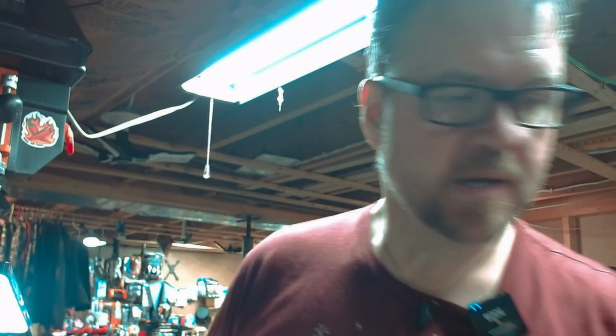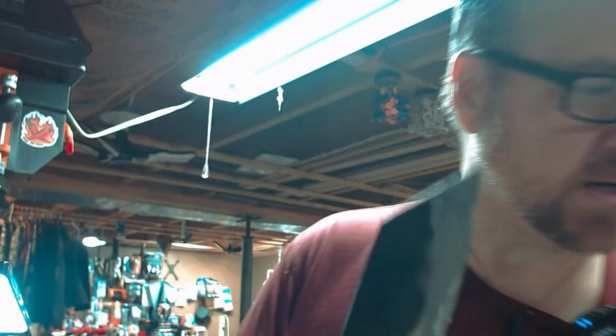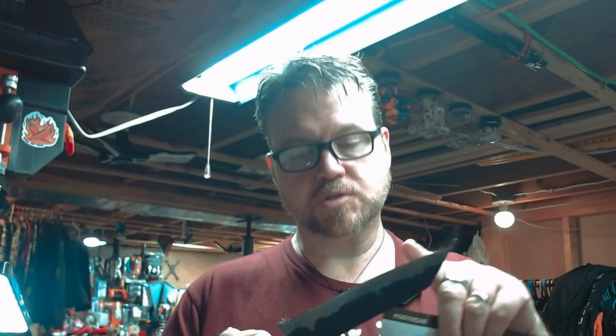I'm doing the ALTSTONE series, the Fukami. This is the 5000 we're going to do now. I want to show you guys a little something real quick first. I noticed that whenever I did this yesterday, we didn't quite get the push cut I was wanting, and there are some of the gouges I was talking about. But I worked it on the strop some more because I got a closer look in certain areas. There was still some burr left. It was small and kind of tucked to one side, but it still removes access to the edge.